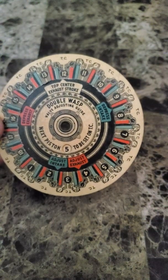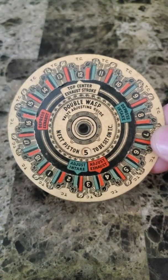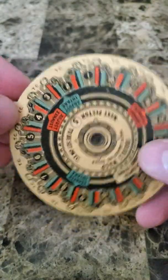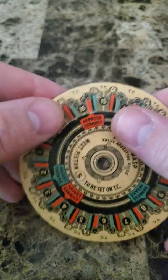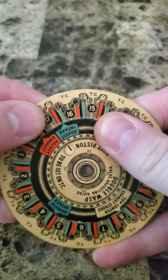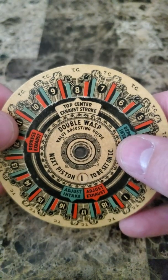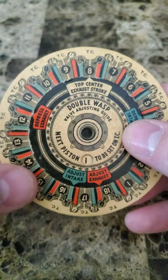Another way to use this is if we're doing an inspection of the engine, or we did some maintenance that requires us to check valve clearance, and we find that a cylinder is not within limit. So what we do is go find the cylinder we want to adjust. Let's say we need to adjust the intake valve for cylinder number 16. Moving this over to where that's at — so that's on cylinder 16 — what that means is we need to have the engine moved over to where top center of the exhaust stroke is on cylinder number eight, and then we can make that adjustment there.